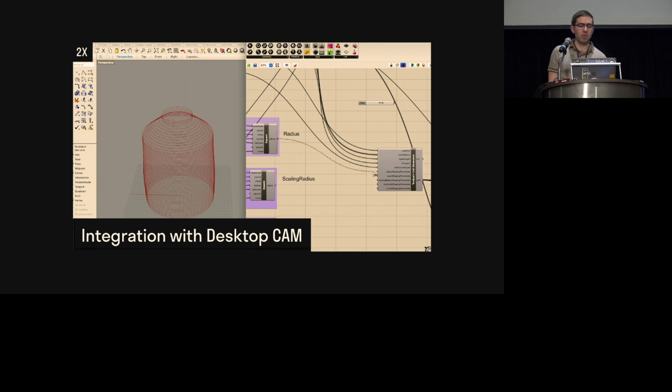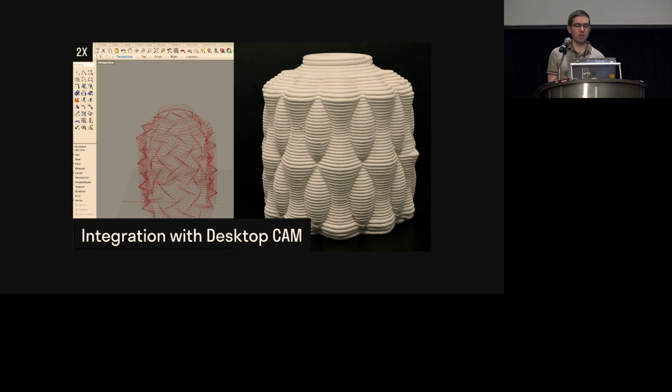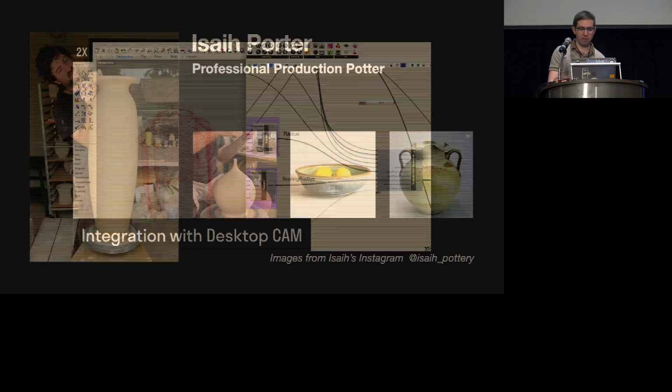While our primary aim was to support digital fabrication design without a desktop computer, our approach can also support novel workflows that incorporate and streamline desktop CAD. We created a despiralizing algorithm that allows the toolpath to be used as a starting input to action-oriented design software such as CoilCam. We believe that starting with handmade forms may be a promising approach to providing practitioners a jumping-off point into computer-based CAD software.